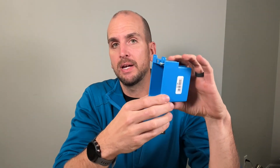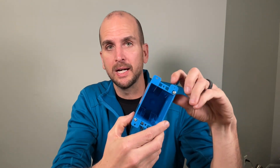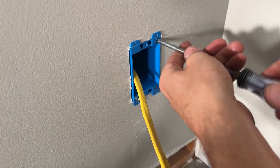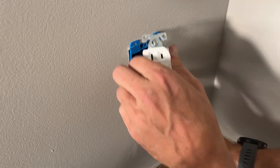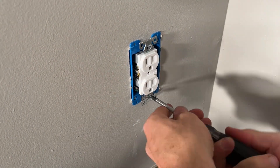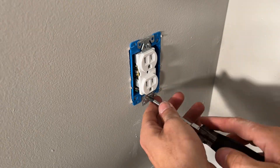So that's the purpose of the plaster ears. The issue is: when should you not be using those ears? That's when you have an electrical box called an old work box, where you actually cut a hole in the drywall and then insert the electrical box after the plaster or drywall is already on your wall. This is actually where I've made this mistake for years and years — even on my most popular video on this channel with about six million views — I have an old work box and I start to mount the outlet but I missed one step because I left those ears in place.